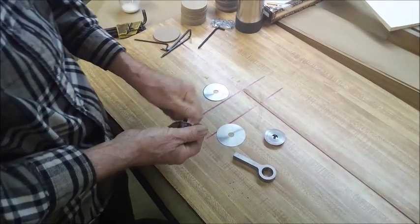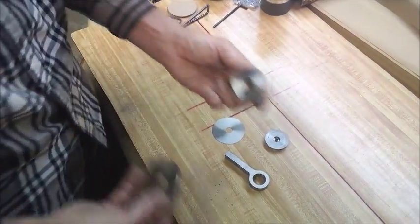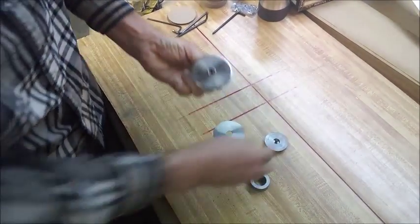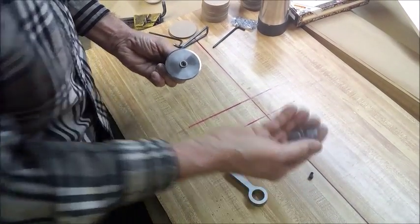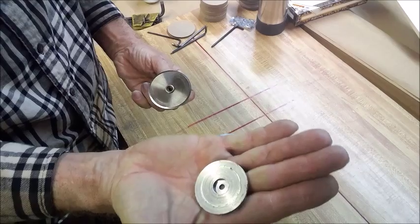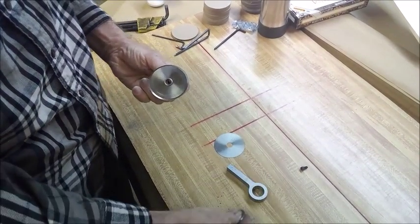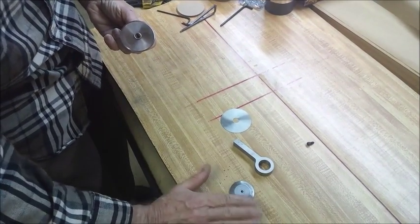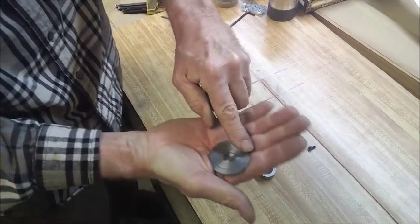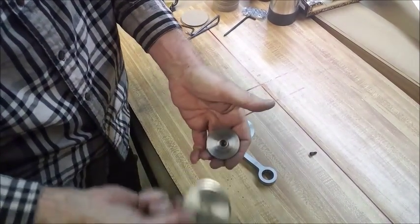Excellent. You're going to put the wheel on now? Yep. The pizza cutter. Little flange made up. Again, this surface here was done in a lathe, then it was put down. Both of these were put down on a surface grinder, and this surface was ground parallel to these sides here, so that you know the flanges were pretty good. But you can basically see how it goes.